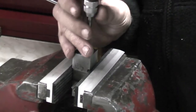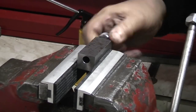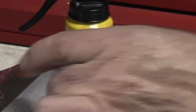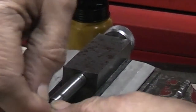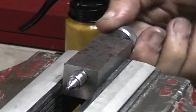The size of the tap — the drill has to put too much force on the 8mm thread that screws in. I'll put the plunger and the spring in — there's the spring, now the plunger. The end of the plunger needs a couple of spanner flats, so we'll do that next.